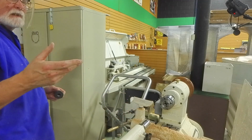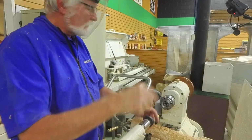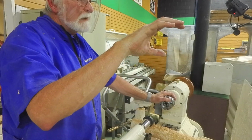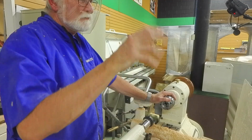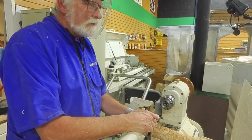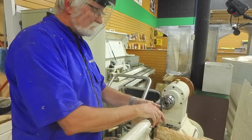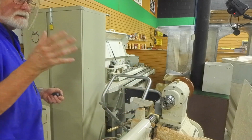But I can do something similar with my vacuum chucks. And my vacuum chucks, I cut the threads for that to fit the headstock. So it's all wood with some foam on the top and then some piece of pipe in the middle and then lots of glue. And I seal it as well because wood's pretty porous. So I would take the chuck and stick it on this end, have my vacuum chuck going, line it up. If I got enough vacuum on the vacuum chuck, I take this end off, I'm in business. And you have to be careful. They hold, but they're not like steel.